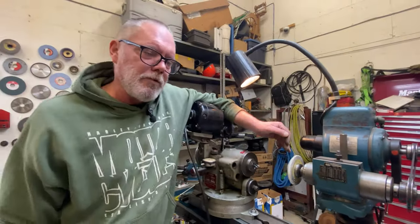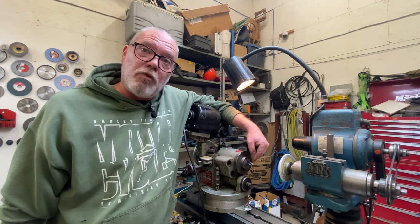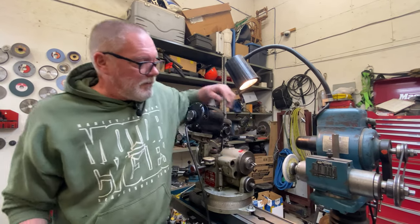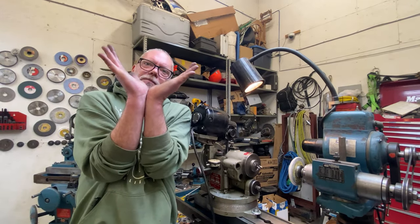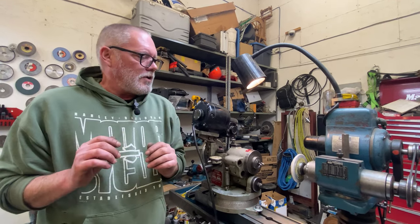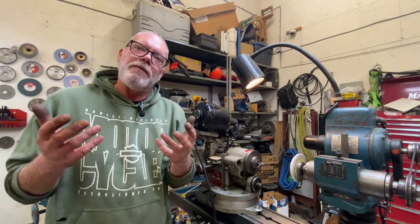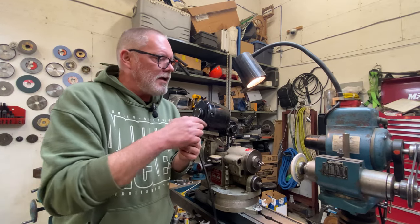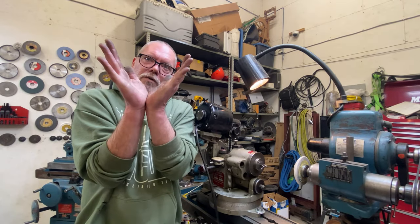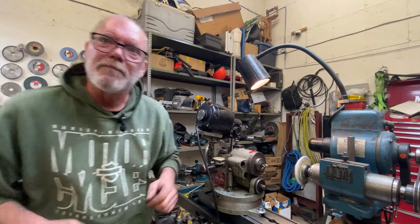And we have to be very careful that we grind the wheel so that it'll give us the correct 41 degrees on the actual workpiece. So basically, because if this was 90 degrees, 82 degrees is going to be like here. So I want to go to the 41 degrees that leaves extra meat on the wheel so that when we actually grind on the part, it removes extra meat on the part and gets me to the proper 41 degrees on the proper side of 45. I hope that makes some sense.